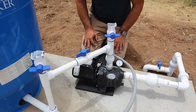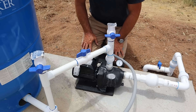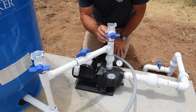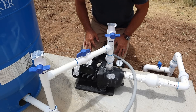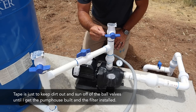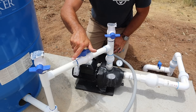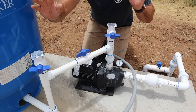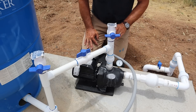Now you should have a basic understanding of how a simple pump house setup operates with a check valve, pump, and pressure tank. You may be wondering about these two fittings here — those are for a water filtration system I plan to incorporate once the pump house is built. I can add a threaded fitting there and there, run the flow up through the filtration system and back down, and use this quarter-turn valve to ensure all water going to the house is filtered. For maintenance I can simply isolate the filtration system and run as normal.